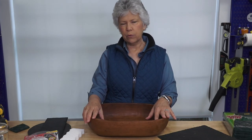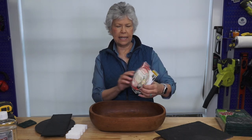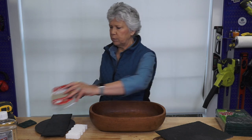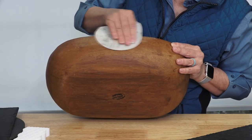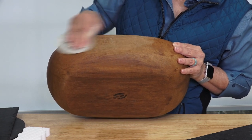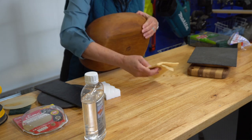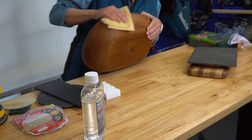It came about because of this bowl right here — it really needs to be reconditioned. To do that I'm going to sand it very lightly with 320-grit sand net, which is very fine, because I basically just want to get all the crud and dirt off. You can put it on a sander or just hand sand it. I love working with old wooden cutting boards and bowls because they're very easy to recondition — just take some sandpaper to it, clean it up, and it's ready to go.